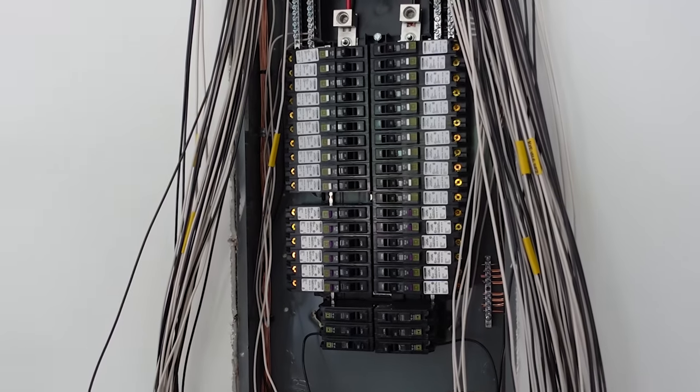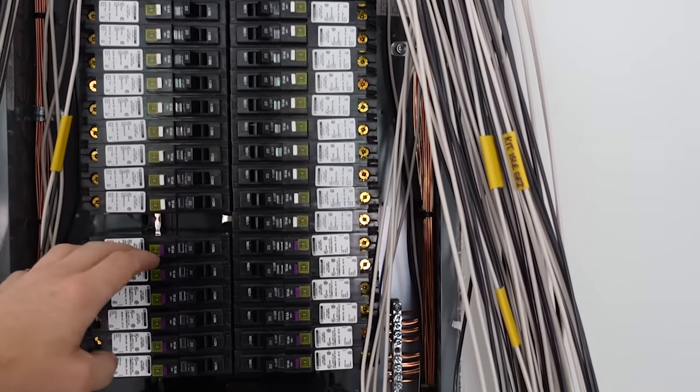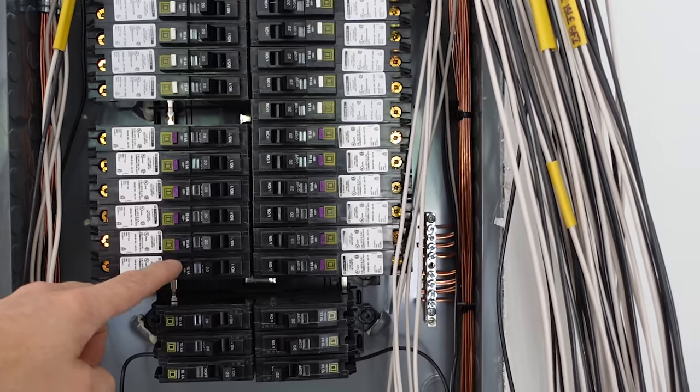So what is a circuit breaker? A circuit breaker is what we call an overcurrent protection device. They're similar to fuses in that they stop dangerous things from happening in electrical circuits by de-energizing that circuit. Typical circuit breakers look like a switch — if you've ever gone to your electrical panel and looked, there's a whole bunch of these little switches. Really all it is is something that connects and disconnects a circuit. They can be thought of as safety shut-off devices.